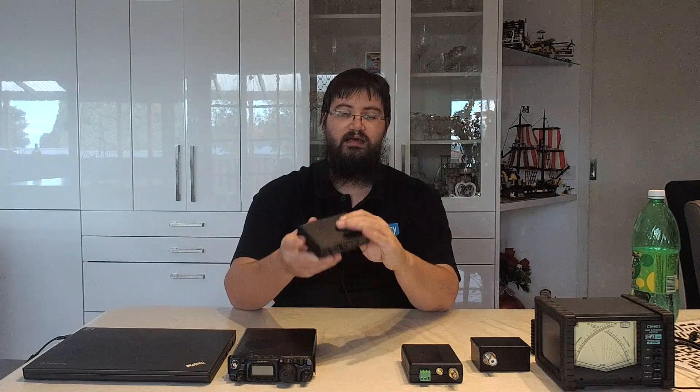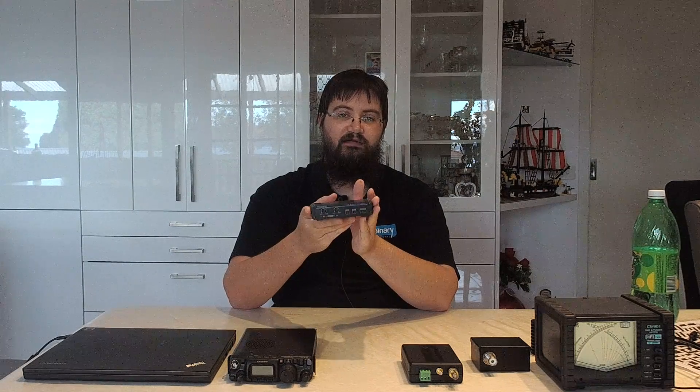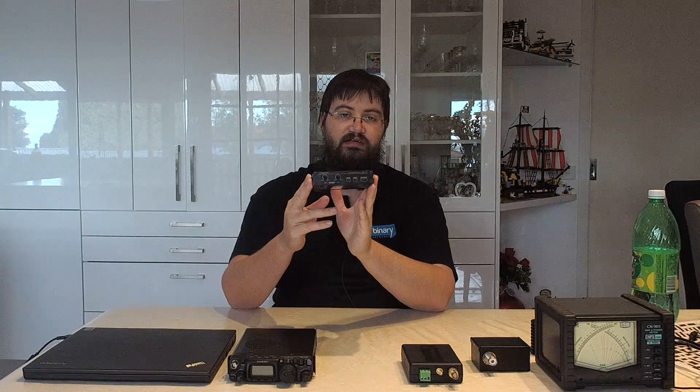You also need a signal source or a sound card that you can connect to your radio to play two tones through. I use a program called Audacity to generate my two tones — it does a great job — but you need some way of getting it into the radio. Radios like the ICOM 7300, 7200, and 7610, and the Yaesu FTDX 3000, have a built-in sound card, so high-end radios typically have the source built in. For a radio like this, you need an external sound source. I'm using the Yaesu SCU-17 to pipe the two tones into the AF section of my radio, as you can get a ground loop between your sound card and radio if you wire the microphone pins directly.